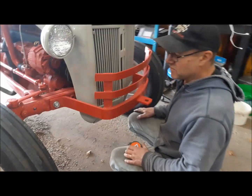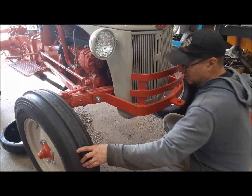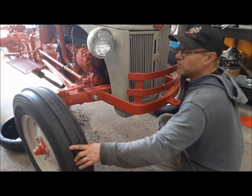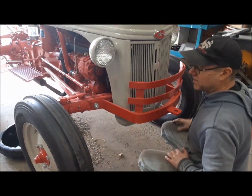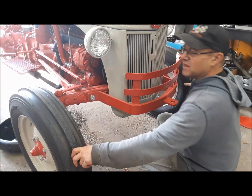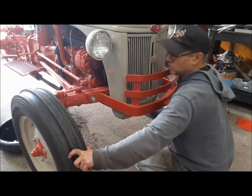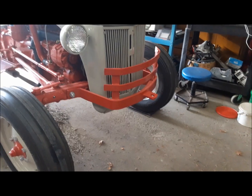I had it out on the road. You can see it's still got definitely some slop between the sectors. I've twirled this thing around and around and around. There's probably just wear on the teeth, and I don't think you'll ever get it out. But what we're going to do is, I can at least now feel it's a lot more positive, so I can now push it out and see what our toe is at and adjust it further if need be.